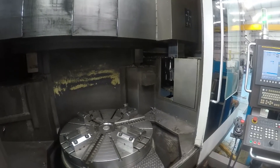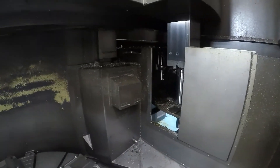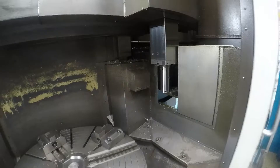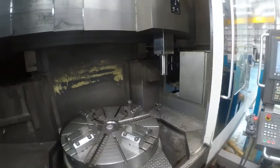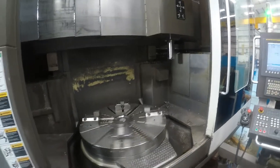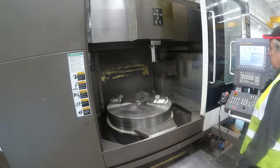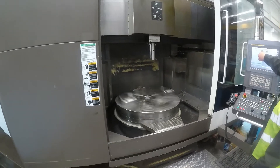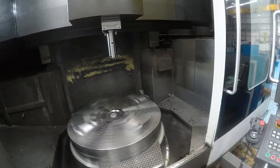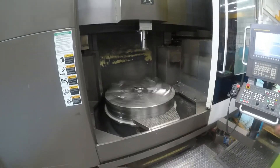So we're going to bring a boring bar in now, and we're going to ramp up to about 100 RPM on the chuck. It's a two-speed gearbox in the table, running at about 88 RPM now — so on the high gear. We're in the table high gear now. Very smooth bearing.